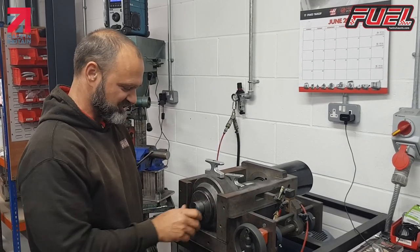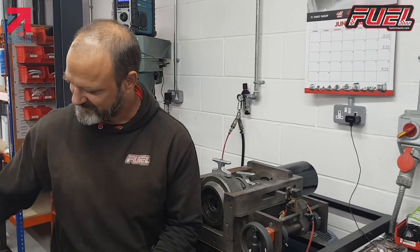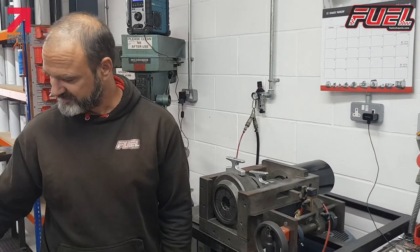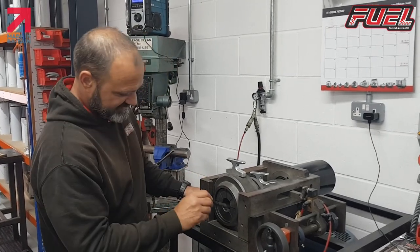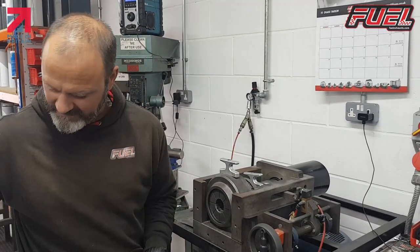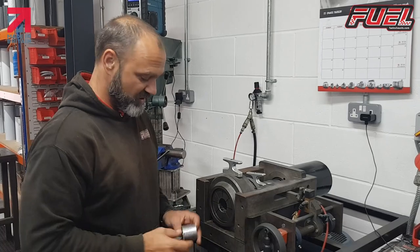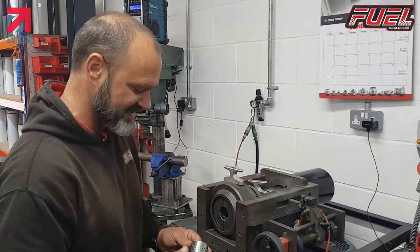So we'll bring the machine all the way forward, back, and I'll just rotate. You just need to take it in like that, pull that out, just go once, and that's done. What we use is a little bit of lube on the inside of here, on every one. Because we're reducing down so much, from this size right the way down to about 32 millimetres, we want it to nicely slide and not to split or anything to happen to the tube.